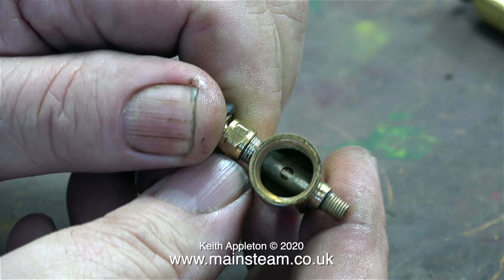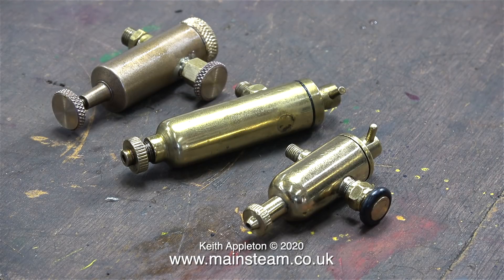For this very ingenious device to work properly you must mount it in the right place. One place you must never mount it is on the boiler turret. If the lubricator was fastened to the boiler, the body of it would be far too hot. The water condenses in the lubricator because it's not as hot as the steam line — the condensate goes to the bottom of the tank because oil floats on water. Depending how far you have the regulator valve open determines how much water passes into the lubricator. The wider you open the valve, the more steam you allow in, which condenses to water and therefore displaces more oil.